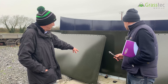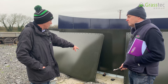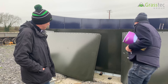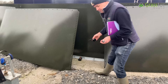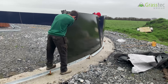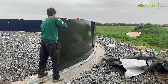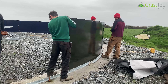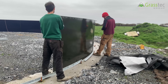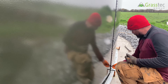When you come on site, you've a galvanized frame at the bottom. These clips here fix the galvanized strip to the foundation. Once the right-angle galvanized piece is in, it starts taking your panels. Each panel has about 110 bolts to fix it, and they're also sealed with a mastic sealant.